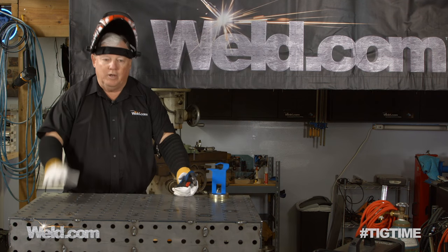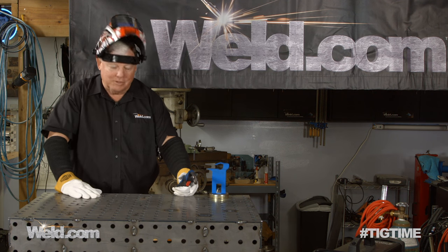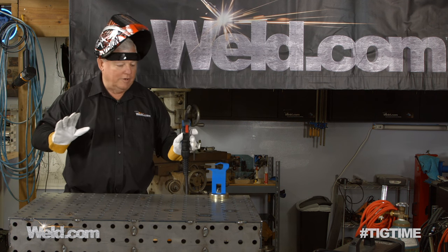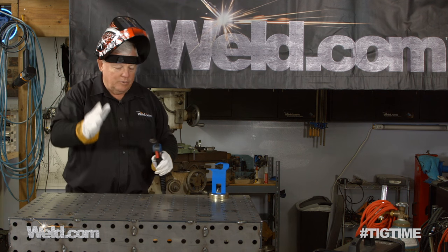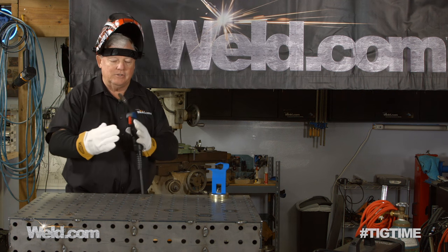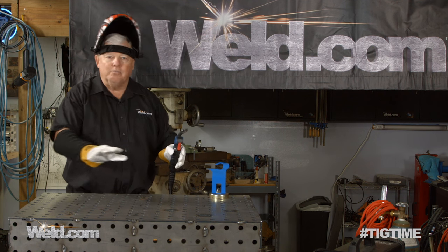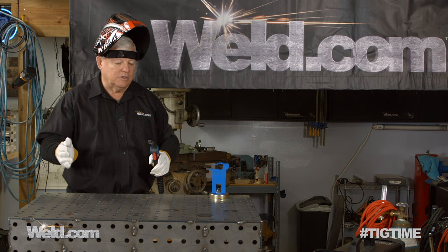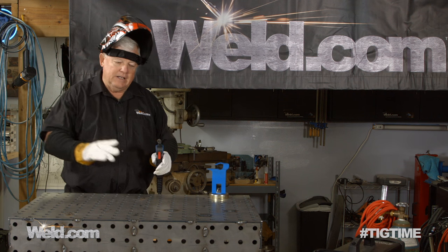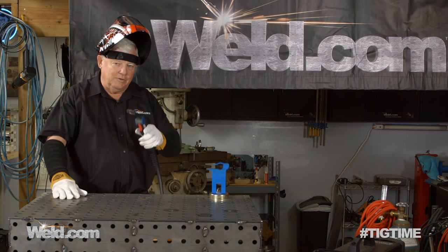It was just that quick. I'm sorry I couldn't save this for MIG Mondays, but I've got to get the table finished and show you how to use it. I'm going to finish off all the slots that are not filled in. A question always comes up: why do you have to weld so many places? This design is so good because it's an egg crate — if you lock it in at all the places, when you start welding on a part, the table's not going to bow on you. I'm going to weld the rest of the table, then take it outside and sand and grind a little bit.